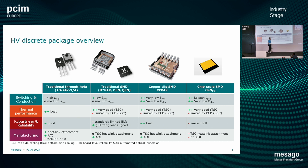On the other side of the spectrum, if we look at chip-scale devices that mainly appeared with gallium nitride in the high power regime: these devices are very small and have very low package inductance, which is very nice for good switching conversion and switching efficiency. They also have very low package resistance, so it is as close as we can get to the chip. And with this type, using top-side cooling, we can achieve a very low thermal resistance as well — very close to the classical TO247 packages.